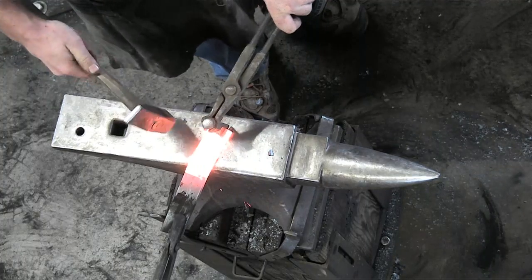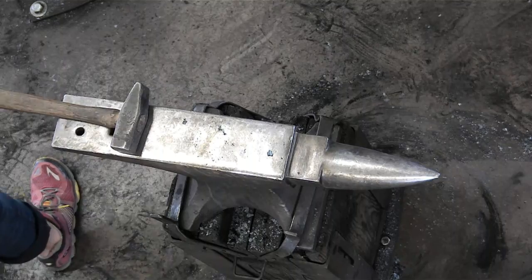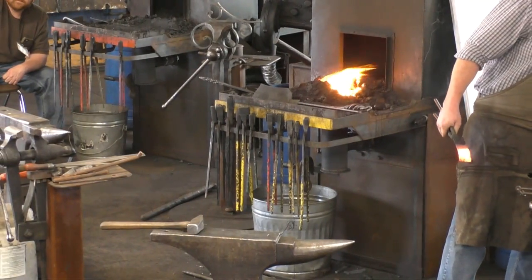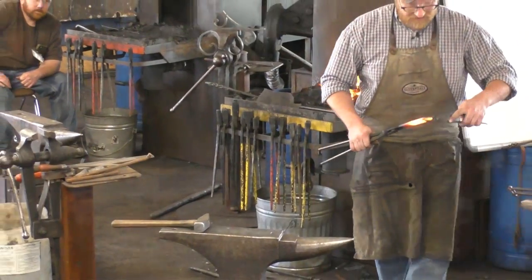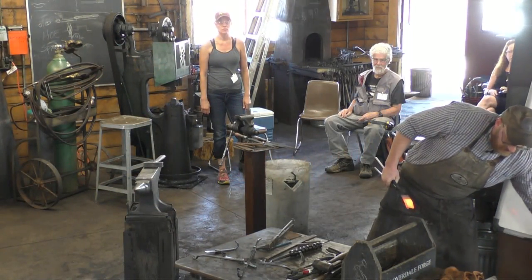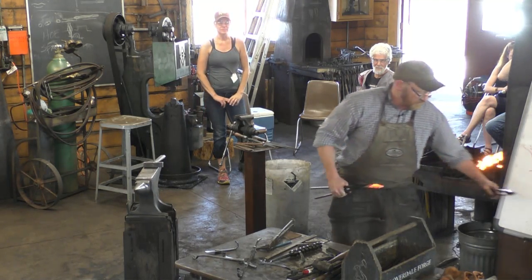Basically, I stopped the cuts about a quarter inch from the bottom of the bar. And the reason I went a quarter inch from the bottom of the bar is because the bar is quarter inch thick, if that makes any sense. So we get rid of that, we hide it in the land of unknown things and just leave it in the bottom of the barrel and someone will clean it out later, right?